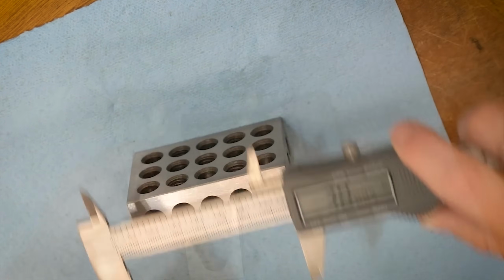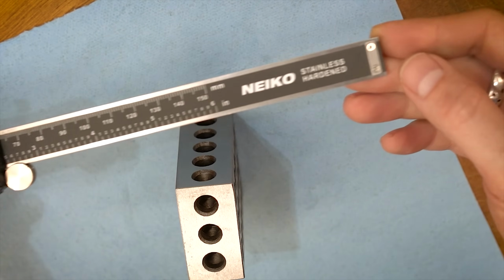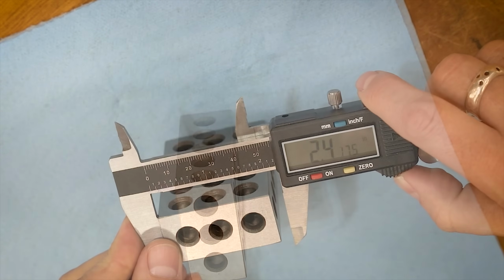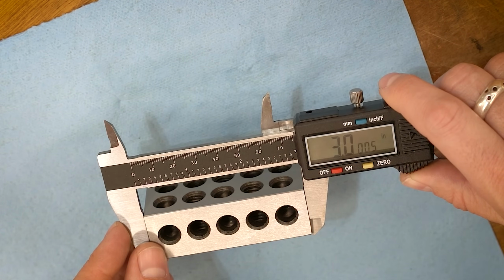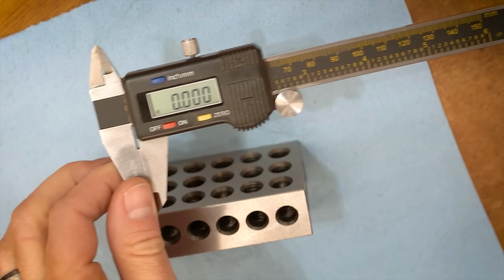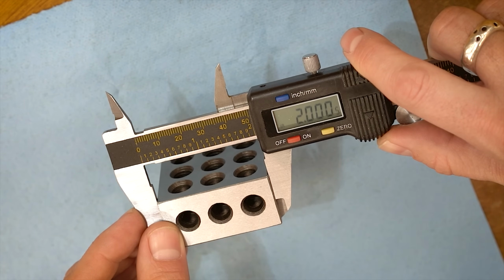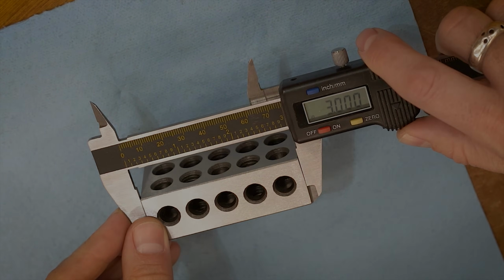The stated accuracy for the calipers that actually state their accuracy is listed as plus or minus 1/1000th of an inch, and they all have a resolution, except for the Mitutoyo, of about a half a thou. So everything is within tolerance, and it is accurate as far as I know what the true measurement of the 1-2-3 block is. So no real difference between any of these calipers.